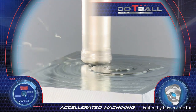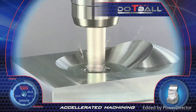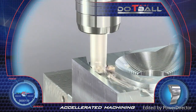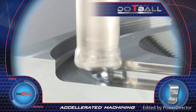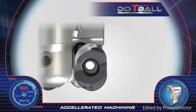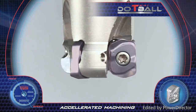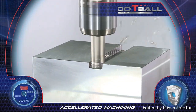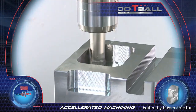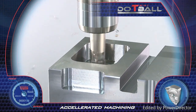The insert's helical cutting edges and high positive rake face angle result in a soft cut, which provides excellent chip formation. The insert performs face machining, slotting, plunging, and shoulder milling. The HJ rectangular insert is used for high feed milling up to 1.5 millimeter feed per tooth in slotting, ramp down operations and pocketing. Accelerated machining and very high productivity achieved with Do Twist Ball.